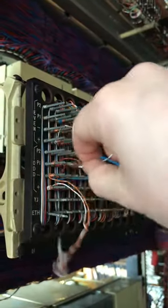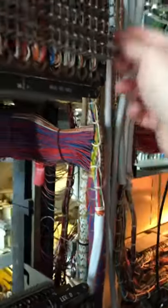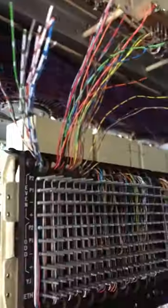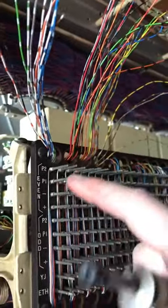Let's start taking these old wires off these wire wrap terminals. I've cut a length of cable — this has got 20 pairs of wire in it — and I've started to cable lace it with this waxed twine so it looks all pretty. I brought the cable up and brought out the wires through the correct holes here above the wire wrap pins.